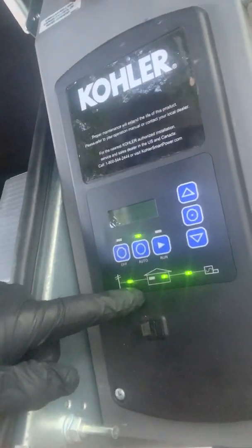The AC hasn't come back on yet — it's probably in the thermal cycle cooling down. But as you saw before, I was drawing about 40 amps and this generator puts out 50, so it's fine for our day-to-day consumption. 14kW is plenty for us. I'll simulate turning the power back on now. Power's back on, the generator goes through a cooldown cycle — maybe 30 seconds to a minute. Gas pressure is still good at about seven inches of water, within the five-to-eleven-inch spec.